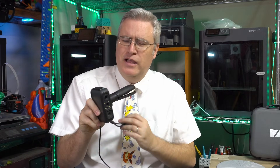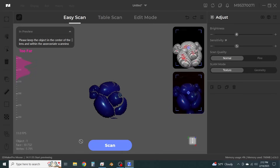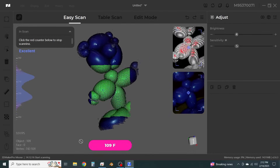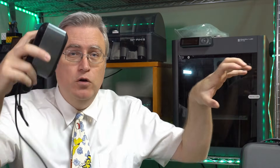As soon as I switched to hand scanning, I quickly realized it doesn't scan like this — it scans like this. You've got to scan with your hand up. Scanning around, despite it telling you the scanner is in the right place, you're just not catching what you're trying to scan. Eventually you realize the scanner works like there's a block — a capture area — that's tethered to the device. Wherever you move it, that area follows, and you have to pass it in, around, through, and over the object you're scanning. Once I understood this, I understood why the table scan didn't work — I didn't have the distance just right.